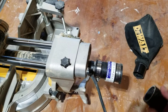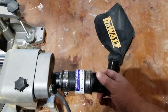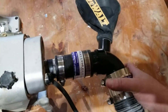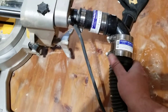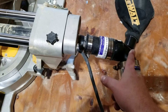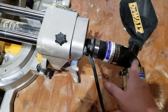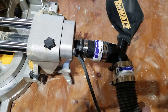So I have this inch and a quarter by inch and a half flexible coupling and this little tiny piece of inch and a half ABS pipe that I cut. Put the 90 on and then just tighten this gear clamp down. This is a two by two inch no-hub coupling, a two by inch and a half ABS all-hub 90, a tiny piece of inch and a half ABS pipe, and this coupling. As I said, you can do it any way you want — you're going from an inch and a quarter hub to a two inch hub to attach this vacuum hose.